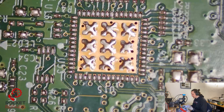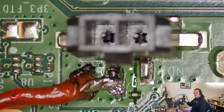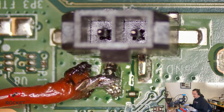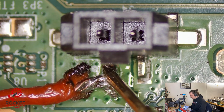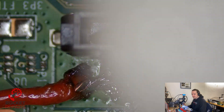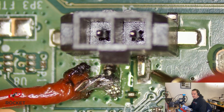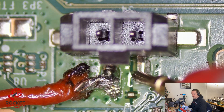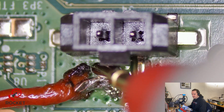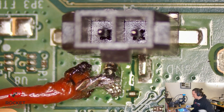So what was that cap dragging down the circuit? Let me just triple check and make sure that on the 12 volt rail the short is also gone — switching to continuity mode. No beep on continuity mode. You can see I'm touching the 12 volt here, and here we have ground so you should hear a beep — there you go. But here, no beep. I think we've solved the short. That's really, really good — just one little capacitor.